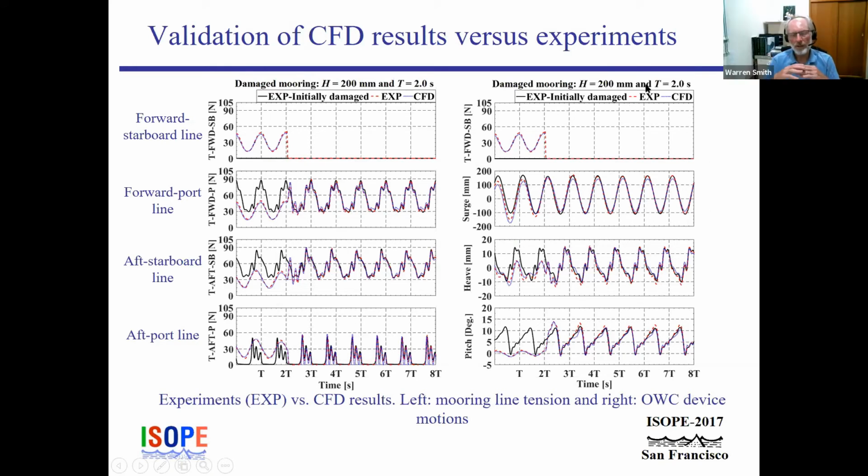Yeah, can I just pick up on the fact that you're modeling vertical tension legs as opposed to anything at any angle? Well, even if it was in tension at some angle or had some slack in it in catenary, what is done out there in practice? Do they tend to spread, or try to keep the same plan profile for the foundation as effectively the floating element?